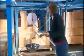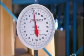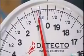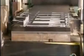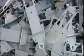The weight of produce hanging in the pan pulls on a pair of springs inside the scale. They move the various internal components that turn the pointer to the corresponding weight mark on the dial. To make the scale's frame, a press stamps a steel plate 5 times, progressively cutting and bending it into the final frame shape.